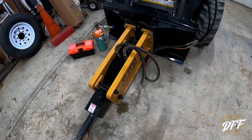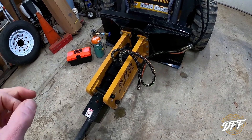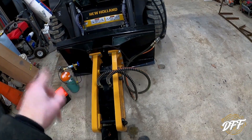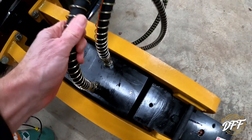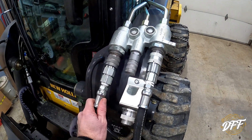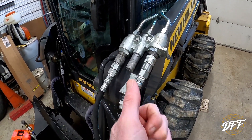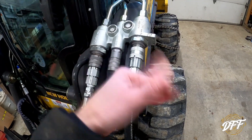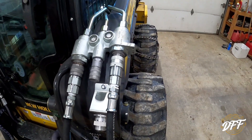We're back in the shop. I headed up for that last clip and forgot to turn the camera back on. It did the same thing — it worked a couple of times and then quit. I just checked the nitrogen pressure and it's fine. I'm not sure if there's a hydraulic oil flow issue. These hose connections keep seeping — I got them as tight as I can. I don't know if there's just a pressure issue, so what I'm going to try is changing the way the machine flows oil into the hammer. I have a toggle switch that goes right or left — I've been flicking it right, so I'm going to swap the hose ends so the pressure flows the other way.